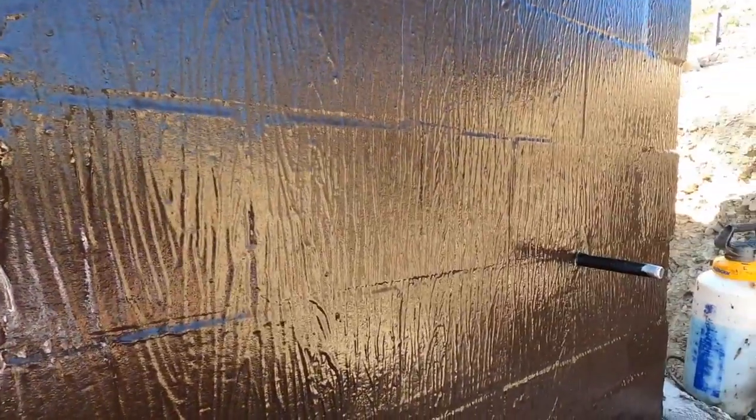As you can see the rapid cure spray has been applied. If there's a little bit of rapid cure spray run down the wall, you don't want to touch your brush back on that until all of the water has evaporated or dried. If you do touch your brush on it, it'll just go hard and you'll have to throw your brush in the bin and grab a new one. We'll see you back here shortly after lunch for the final coat.